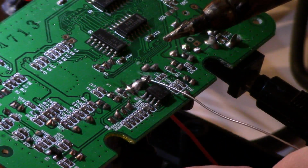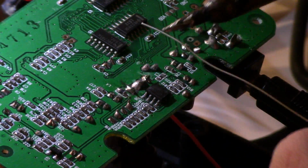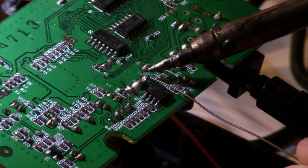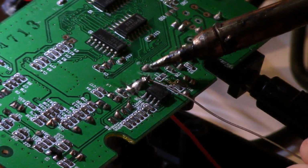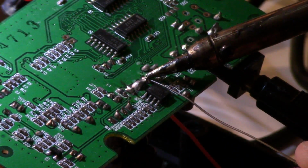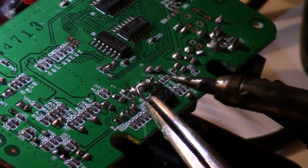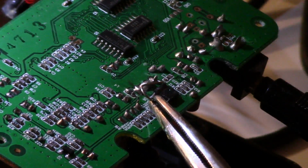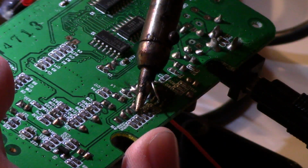Second, you're going to grab some wire or a jumper wire and solder the wire to the audio out pin, and then solder the other side of the wire to pin 7 of the LM358 chip. Now the camera may not show the next results, because I wasn't sure what I was doing eventually. Whatever, I'll tell you what's going to happen on that.